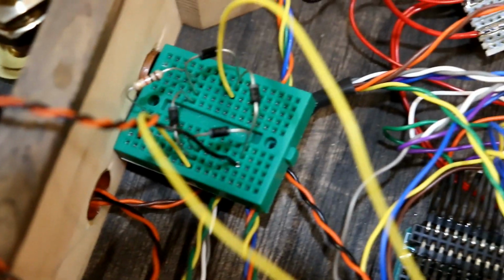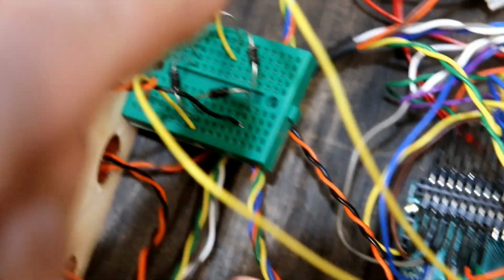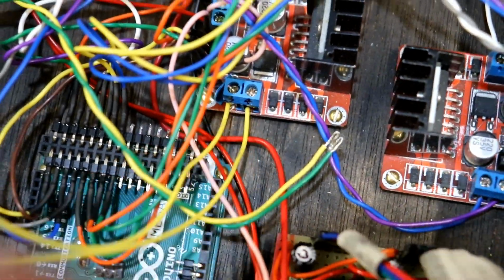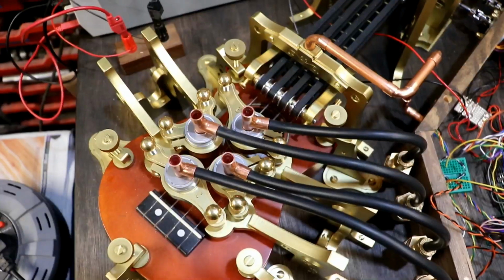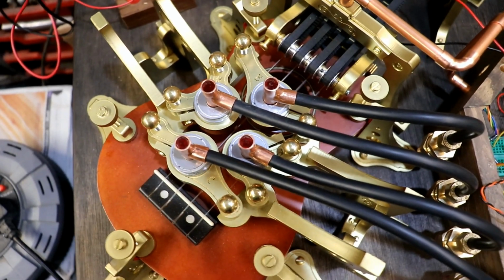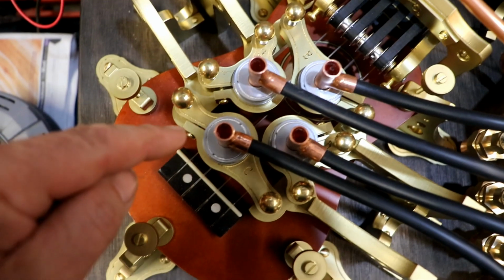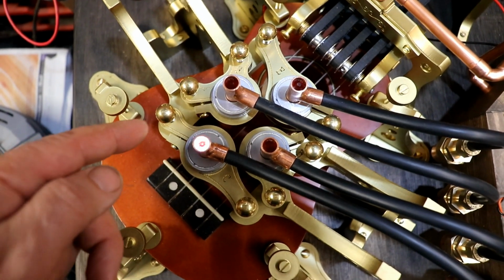Here we are. There's the bridge rectifier. There's the 1K resistor. I've just connected it to the output. I've just taken out the motor wires, so I've connected to that one. So I'm going to switch it on and see what happens. Right. Well, that's brilliant, actually. I don't need any capacitors or anything else. That's quite clear. Oh, that's fantastic.